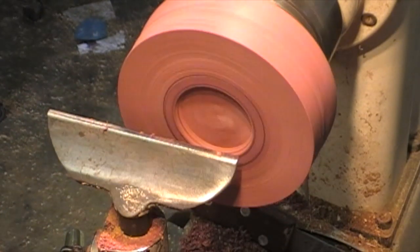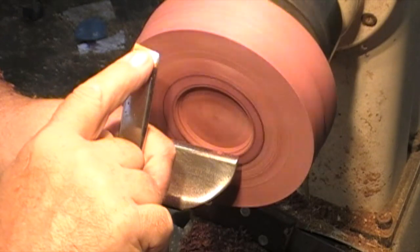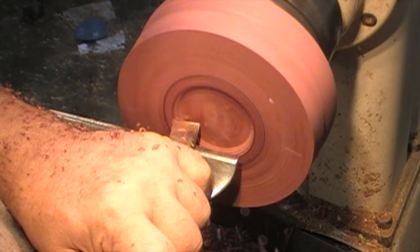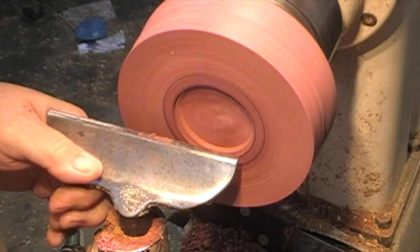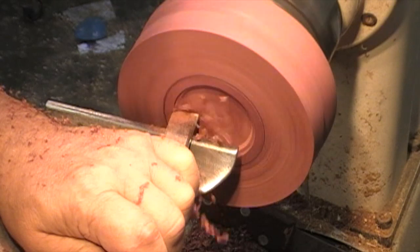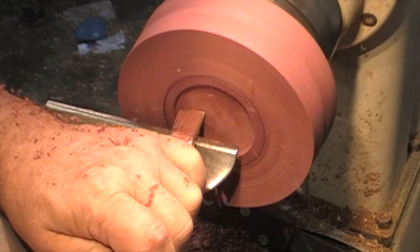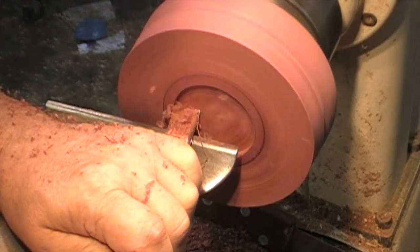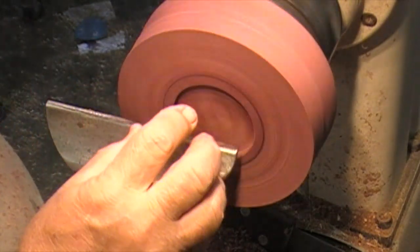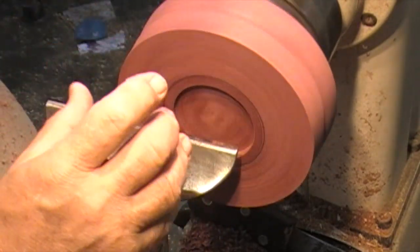Let me explain that. My skew is sharpened on the same angle as the jaws on the number two chuck. So when I do this — and I'm going too fast because I forgot to raise my tool rest to get me back up to middle again, because I want to be at center — I'm going to push in. I put a negative depression this way into that, and that actually mimics my jaws. So when I open those profile jaws, I'll get almost the maximum amount of grab I can get off those jaws.